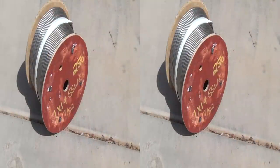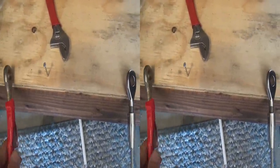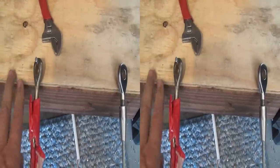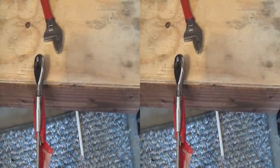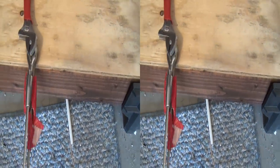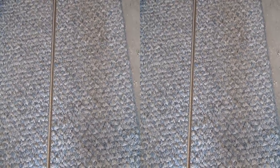I got my 250 feet of stainless steel rigging wire. With one end on, I take the old wire, put it over a nail I drove into a sturdy shelf that won't move, and put the other end of the new wire on also. I use just a little crescent wrench to lock the two together, and now I can pull them both tight to get to the end of the line and make sure I'm at the proper length.